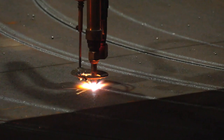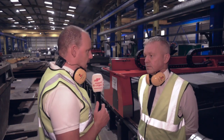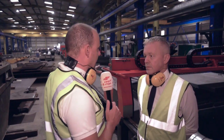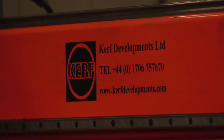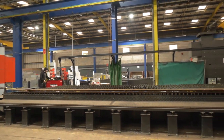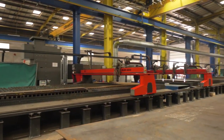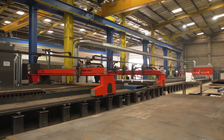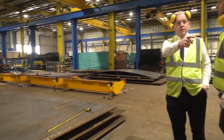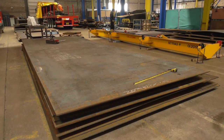On the thinner gauges — okay. And with these Kerf machines you've got here, you've got flame cut and plasma cut on the same bed. Is that because you have such diverse heights, thicknesses, and sizes of materials? Yes, there's every chance that material we put on the plasma machine will also need flame cutting. The way the factory is designed, everything in this bay is carbon steel — whether it be water jet, laser, flame, or plasma, there's only carbon steel in this bay.